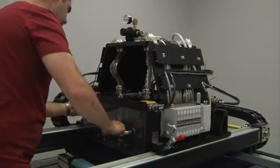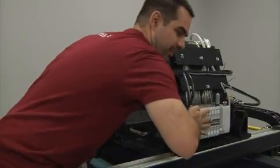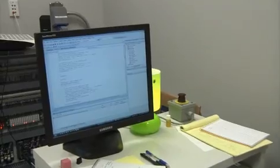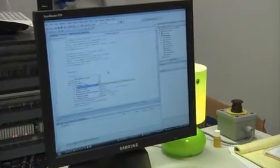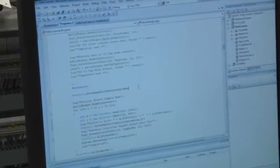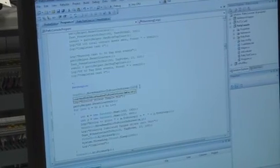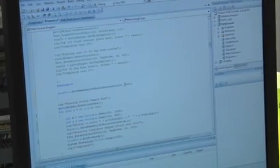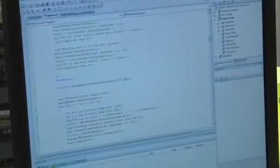So we designed a static class around what we call the head unit, which is the part that has the spinning parts and the XY axes. And I made a static class that has, I'm going to go to the code here. And off of head unit, we made methods move to center, move to point on screen. And I can simply pass in point on screen here. And that call there will actually move the head unit to that point.